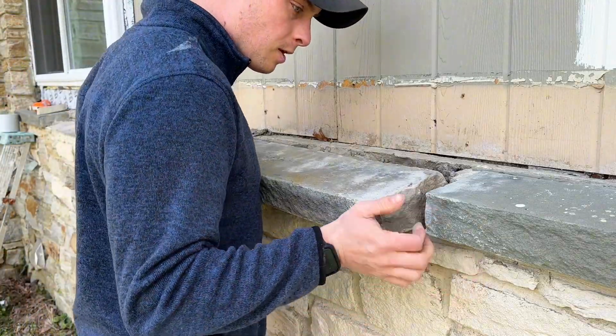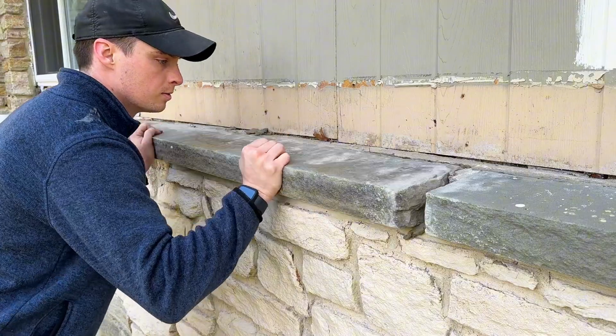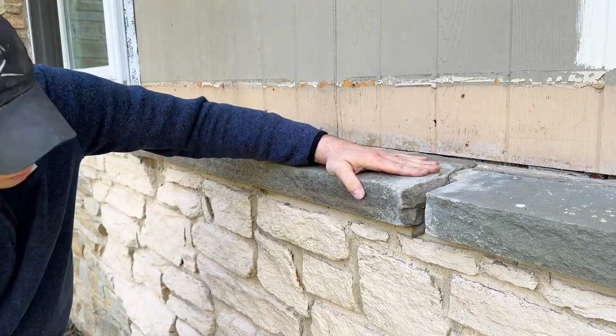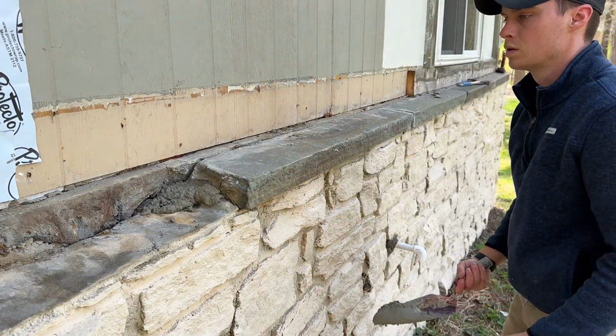Now make a nice thick and flat base of mortar mix on the ledge and set on your rock. And on this step, make sure to apply enough mortar before setting your rock that it starts to push through the top and bottom cracks. After double checking the placement of the rock on the ledge, now it's time to tackle rock number 2.